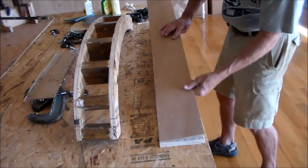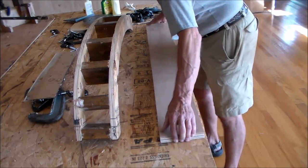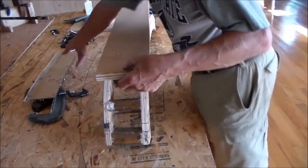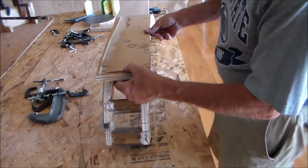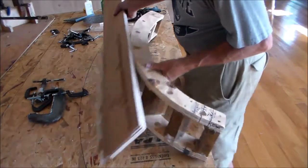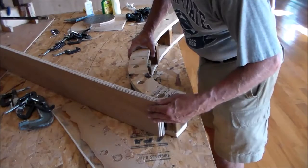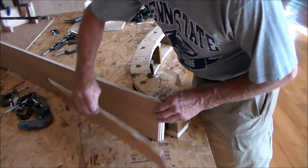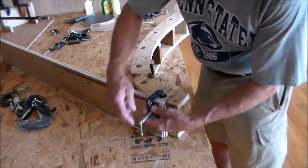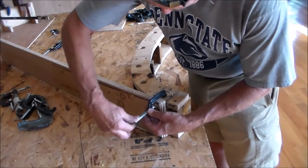You can see the saw kerfs and I'm placing those downward. To support the back of this glue-up, I'm using a heavy piece of flexible plastic as additional support to keep from breaking the plywood. You can also use a piece of sheet metal that would do the same function. I placed a reference mark on the tight end of the jig and I start my clamping from this mark on this end of the jig.